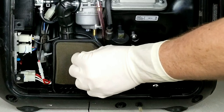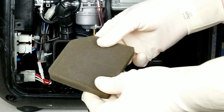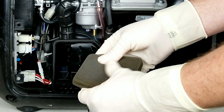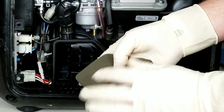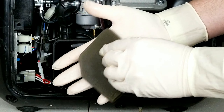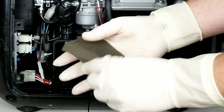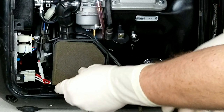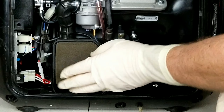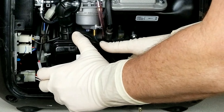As you look at the air filter it's actually pretty clean. We'll inspect it — the air box looks great, and this filter is not really dirty at all. It has a nice thin layer of oil on it. If it was dirty, you would put it in a bucket of Dawn dish soap, dry it completely, then re-oil it by putting it in a sandwich bag with just a teaspoon of oil so it has a thin coat on the outside. Since it looks good, we're just going to put it back in.